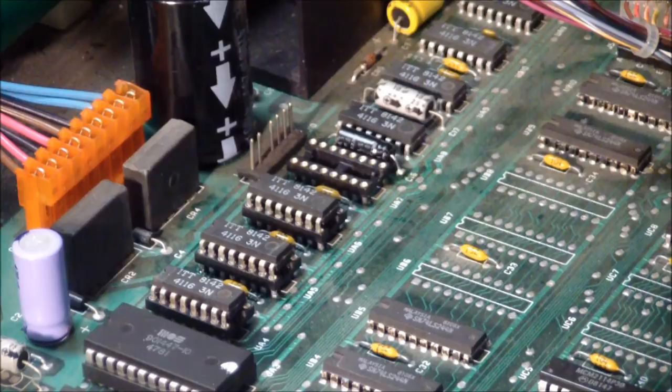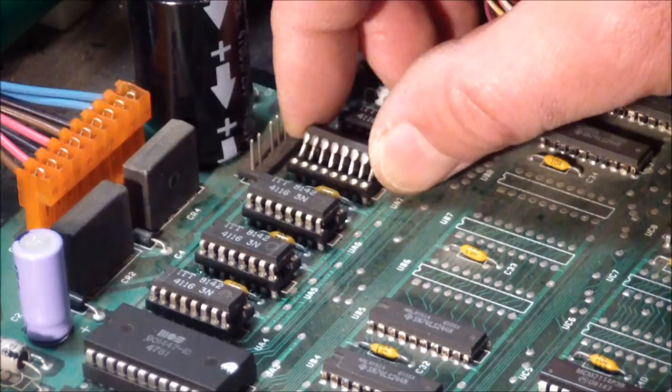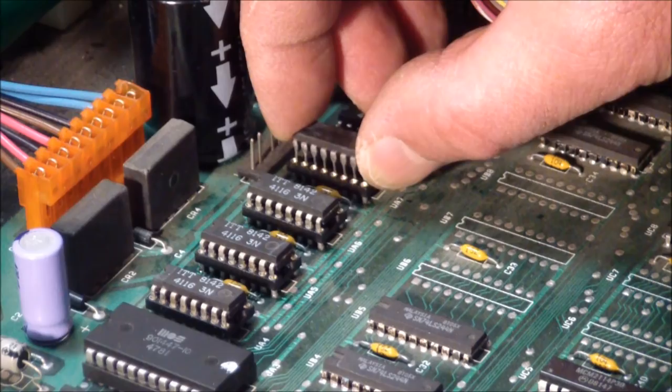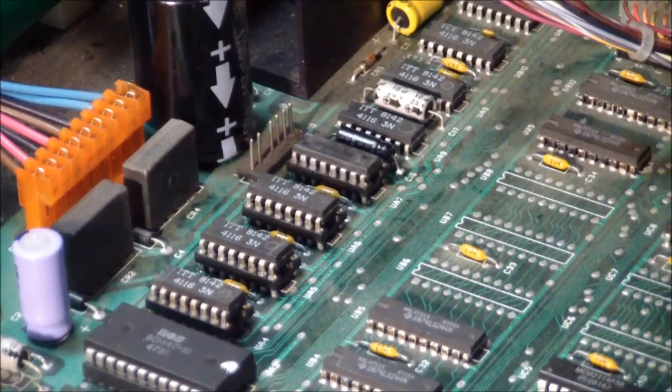But what I do is I go to my stash, get out a replacement, I tested a known good one, we'll put that in, making sure that it's aligned correctly. I mean, do not plug these in upside down or wrong, because they will fry immediately and probably take a bunch of other stuff along with them. Yes, notch is on top, we're good, and let's not forget to plug in the display cable, and off we go